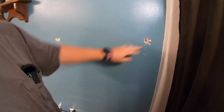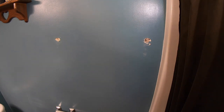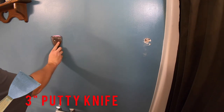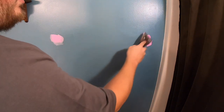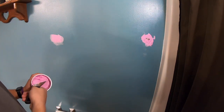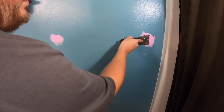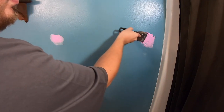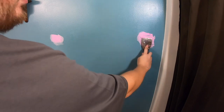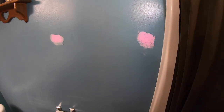So we can get a nice flat area. We're going to use spackling — it's a DryDex spackling — and go ahead and open that up. I'm using a three-inch scraper and putting quite a bit on. We're going to do this a couple of different times, but you do want to let it dry between each coat. I did go too aggressive — I should have not gone so aggressive; this will probably take a little more work. Go ahead and clean that up pretty well and let it dry. In this video you'll start to see it turn white, which tells you that coat is done — it is that fast dry.